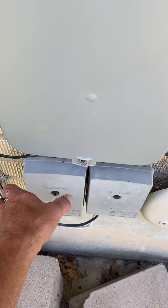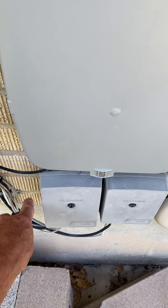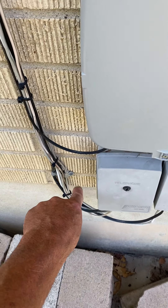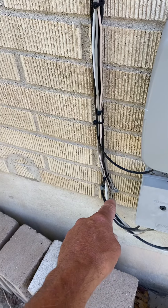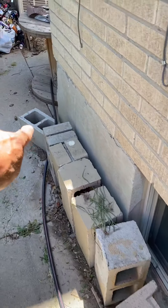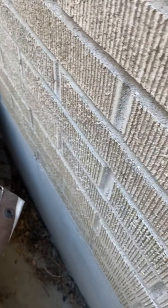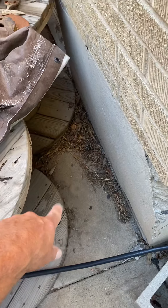The line set will come out right here. The joist space is open from the flues, so we'll run the line set just outside along the wall, then around the corner to the condensing unit. It will fit on the cement pad, so no pad is needed.